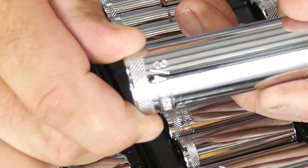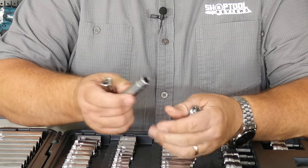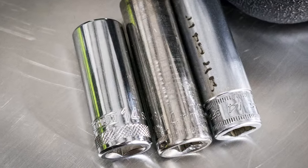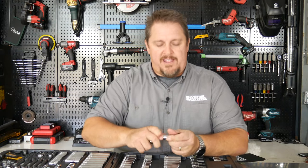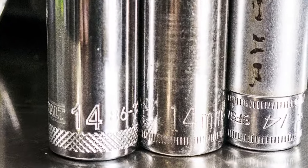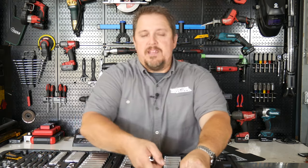That's called their direct torque technology and it's on all these sockets. You'll also notice they have a knurled band all the way around so you can grab the socket with your fingers and turn a fastener if needed. Comparing to an old USA-made Craftsman and a Snap-on socket — all 14 millimeter — those have some knurling you can barely see or feel. But this knurling band you can actually feel, so you'd be able to grab and turn something. You can also easily read all the sizes — they're engraved or heavily laser-etched, and you can feel and see them clearly.